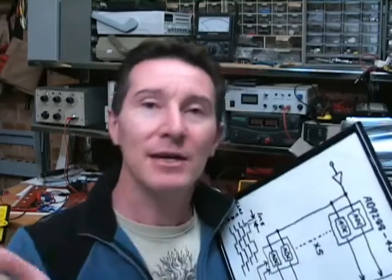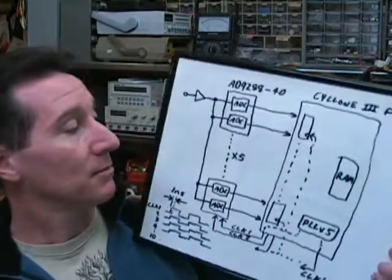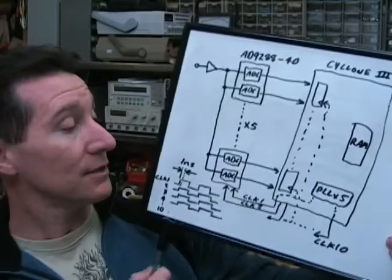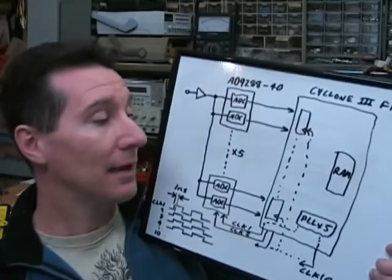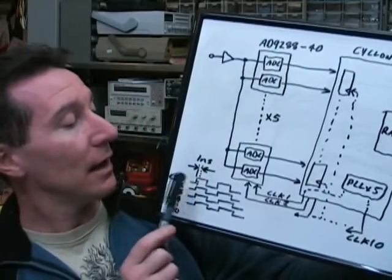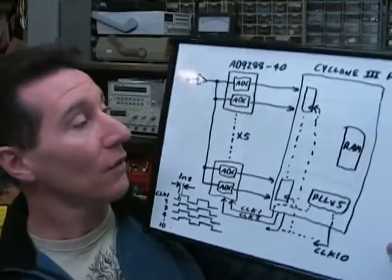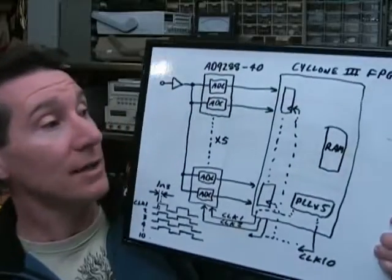You do have to be very careful — your clocks have to be spot-on. You can't have much jitter, because any jitter in the clock signals manifests in the sampling. When you do FFT functions in your scope, you can get errors in your signal. It's not a huge deal in a low-end scope, but you do have to put a lot of care into tweaking it just right so that you get very low jitter and highly accurate one-nanosecond-spaced clocks. Rigol have obviously been able to do this — they've tweaked their system well enough so that it works, and there's nothing inherently wrong with that.